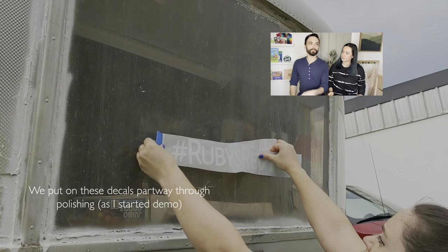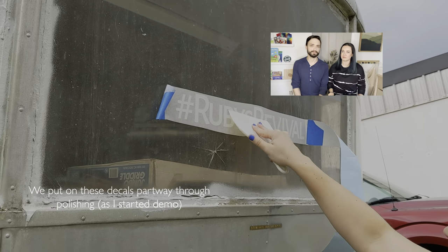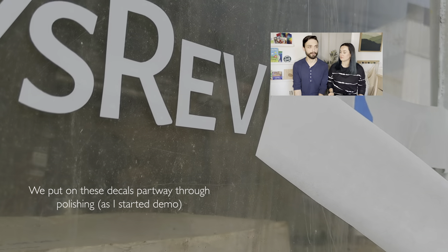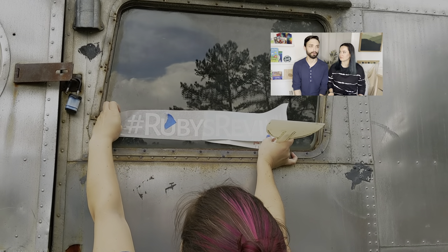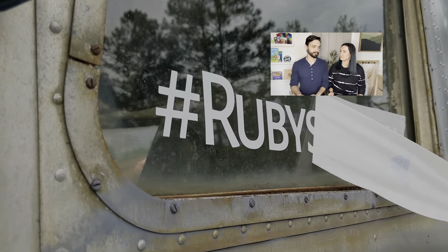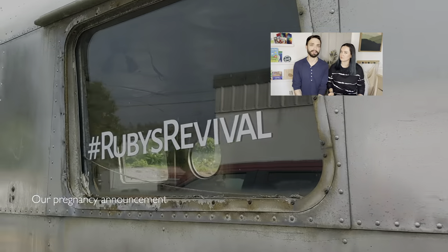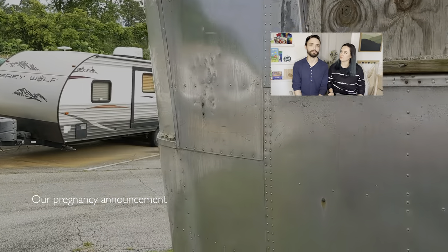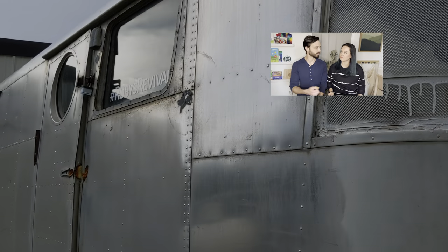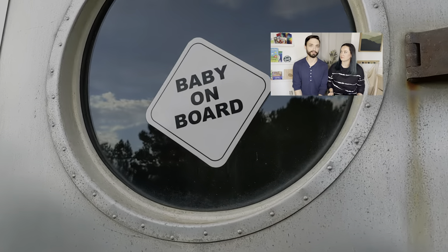Circling back around to why we did this original polish — we just wanted to get an idea of the damage and whether the aluminum panels are actually usable. How many do we have to replace? As it turns out, we're pretty lucky in that aspect and we only have to replace maybe one or two panels. Next step, first we replace those panels, and then we'll go through and sand down anything that we need to. More than likely, we'll sand the entire shell with a really high grit sand just to get rid of some of the harder indentions, the deeper scrapes and cuts, and then we'll do the final professional polish.